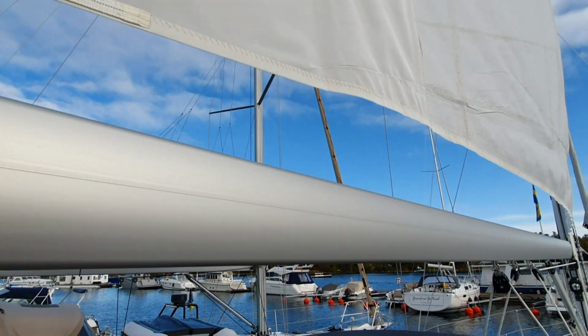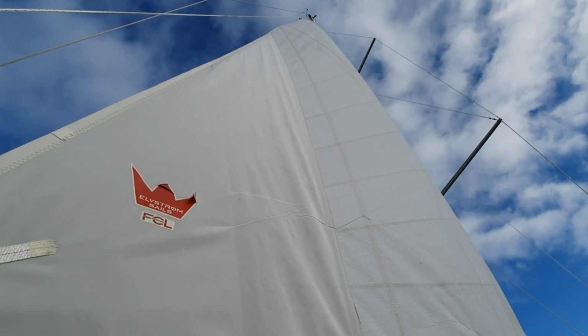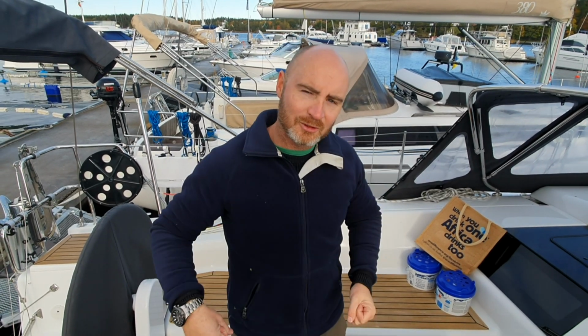Today we are winterizing the boat a little bit, so we're going to take the sails down. We've got the mainsail up now. We've got to take the battens out of the sail and get the sails down, give them a bit of a scrub off as well. We've got a tarpaulin to put on the car park, so we're going to lay the sails down on that tarpaulin, give them a good scrub off, and then try and dry them. But we may have to take them home to dry them because it's only like 2 or 3 degrees.